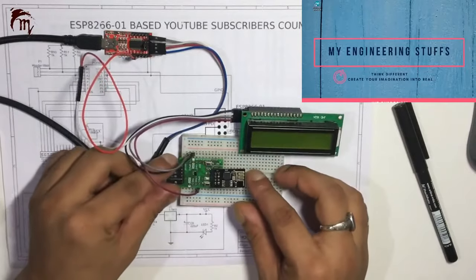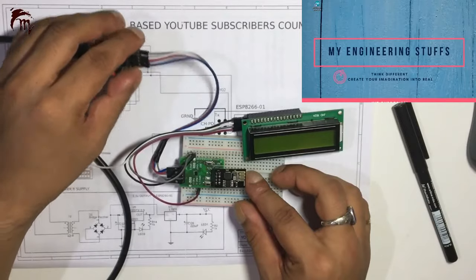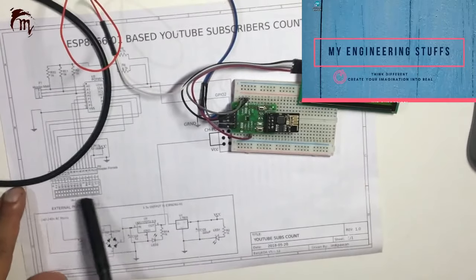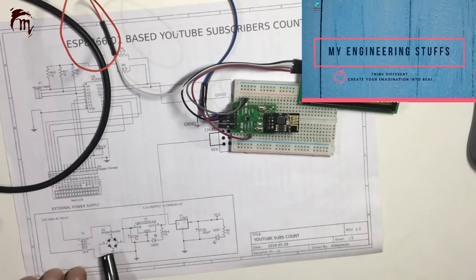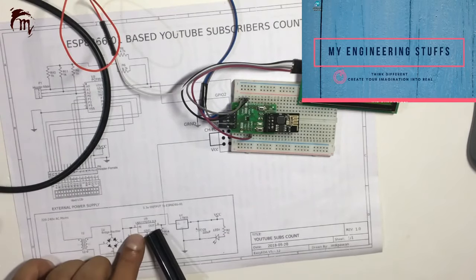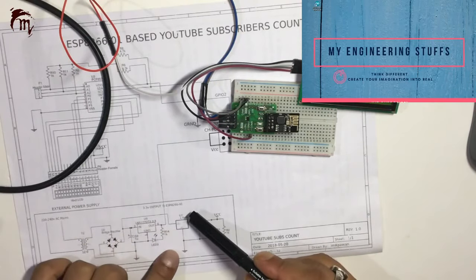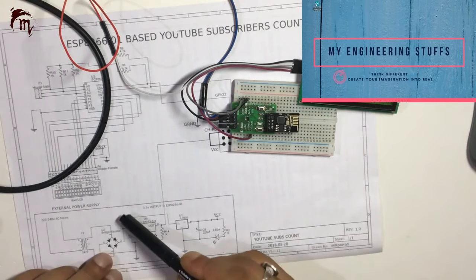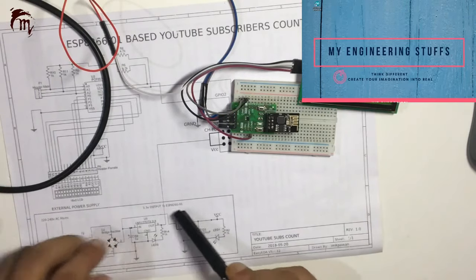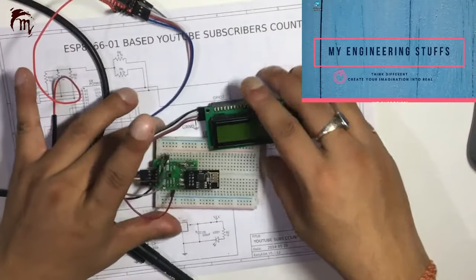After programming, you can take out this power supply, your TX and RX pins with your VCC and ground, and you can provide an external power supply where you are using a transformer, then your rectifier, and using a 1117 3.3 volt conversion and a 7805 for your LCD part and for your ESP8266-01 part. You can make this project standalone.